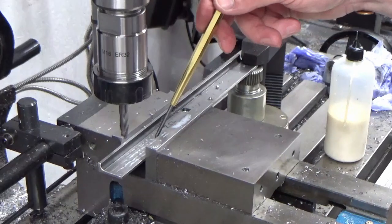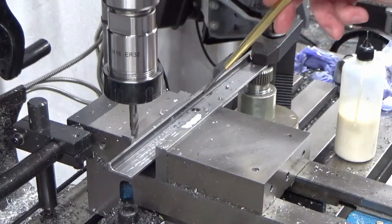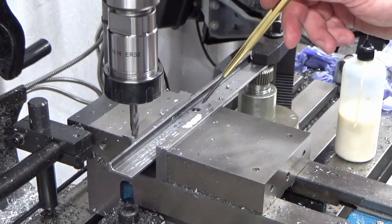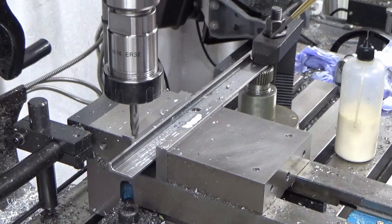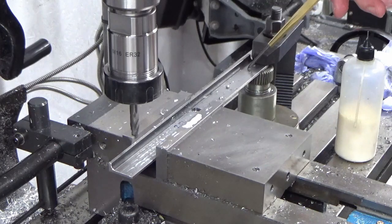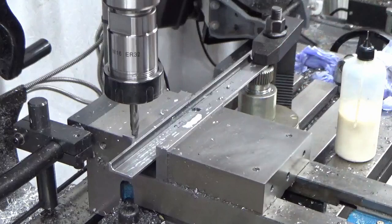Alright guys, we've got our back rail in. We're just putting three slots. There's three slots on the magnet at 4-inch centres. So I've done the centre one. You can see how I set this up. I've set it up so that the first slot was within the confines of the vise. The second slot's going to be just out of the confines of the vise. So that's two slots, well supported. And for the third slot, I've got a screw jack here and a toe clamp on top of it to steady up that third slot. Now this one might make a bit more noise because it might be ringing a bit more out there. So we might have to go a bit steadier on that third slot, but it'll be fine. It's only mild steel. So I'll bring you back in a minute when we're putting this second slot in, just to show you how that looks.